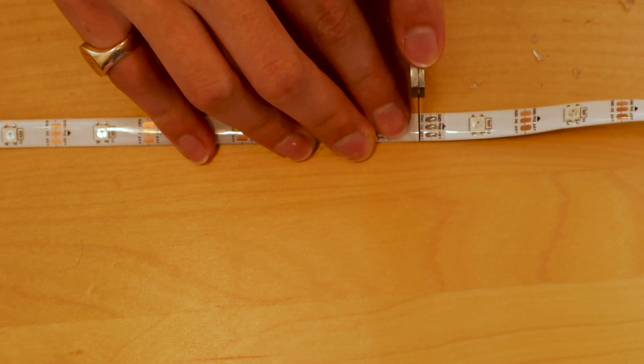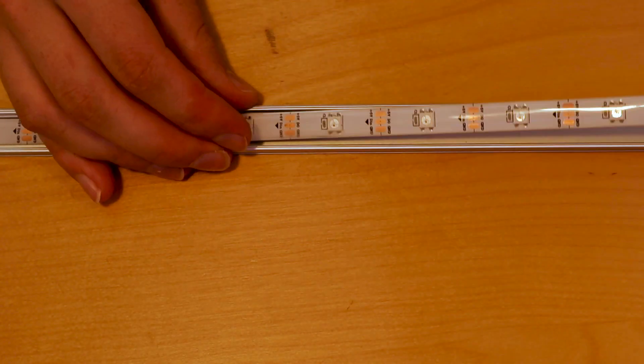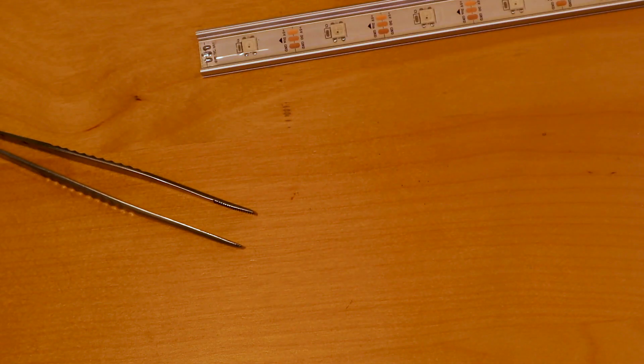I don't want my LED strip to be a permanent installation, so I'm going to cut my LED strip every meter and stick it inside an individual bit of aluminium channel. I'm then going to add connections to each of the ends of the LED strip so I can join them all together when it's in place. If you're making a permanent installation, I suggest leaving the LED strip in one long length — the fewer connections you have to make, the less likely things are to go wrong. But if you do have to make a connection, you can just solder between the two pads at the end of each LED strip rather than adding crimp connections.